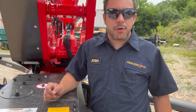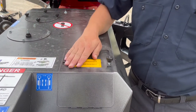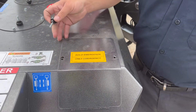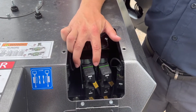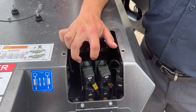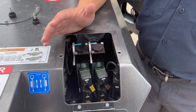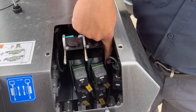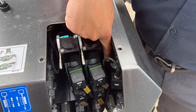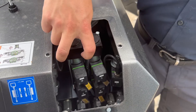If your drive controller stops working, you do have emergency controls back here for the drivetrain as well. Simply take your thumb screws out and open the panel. Usually you can drive straight using these controls right here, but if for whatever reason the machine still thinks it's flying, you can bypass the drive controls by this solenoid valve right here — push, twist a quarter of a turn, and then simply drive the machine.